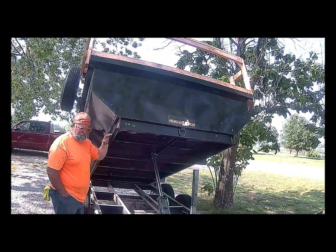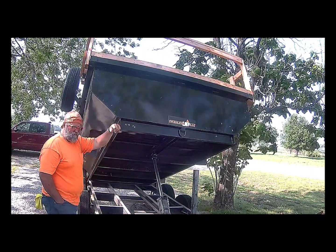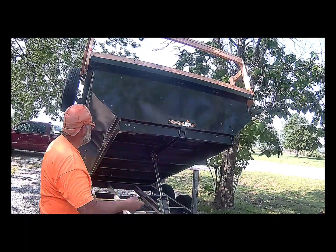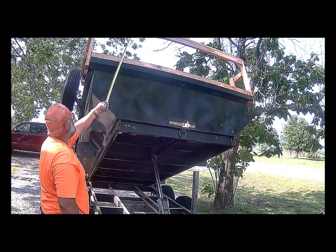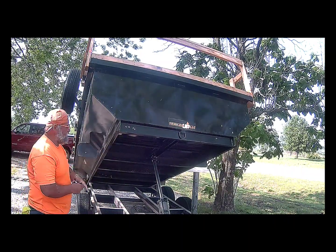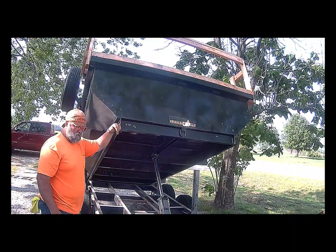So, if you're buying or building a dump trailer, what most people want — from what I've talked to everybody — is 45 degrees. If you go 45 degrees, even if you go 40 degrees, this is 46 inches. So basically, if you go from here and you go up another four feet, which would be even taller, probably about the top of this up here, is where this base needs to be — almost 80 to 90 inches — where you don't have a problem dumping.